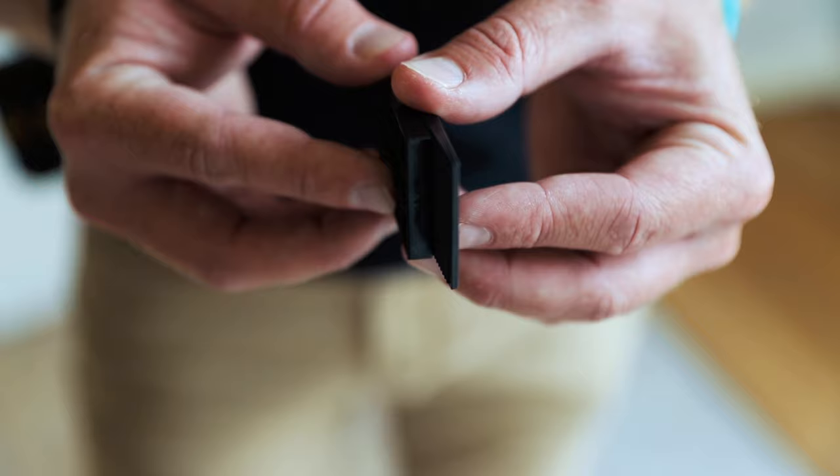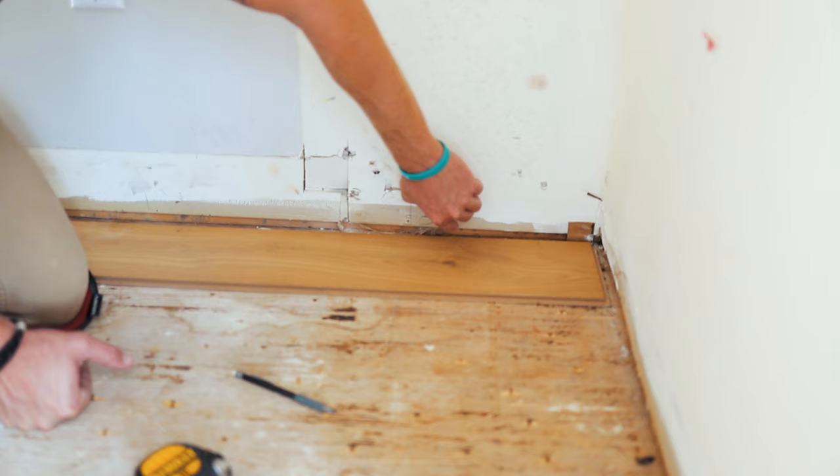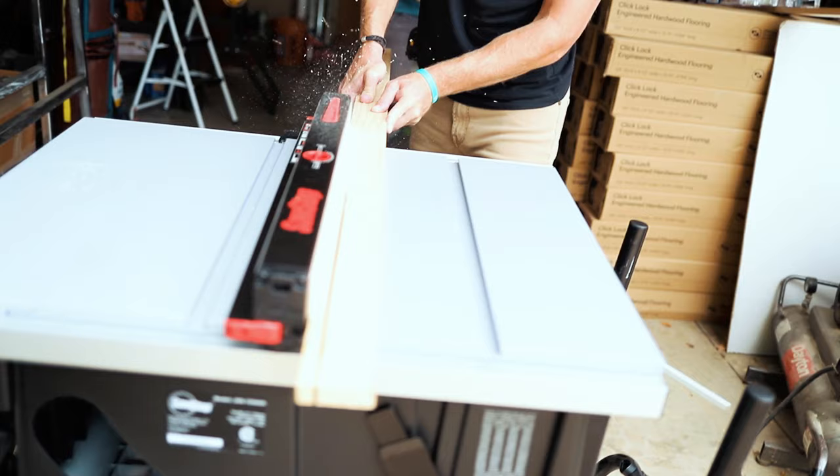It's really important that you get that first run shimmed and braced to the wall. Because this is a floating floor project we're not using nails or fasteners, so it's really important that it be shimmed and braced to the exterior wall so that as you're moving across the floor it stays solid and right where you want it to be. We had these handy adjustable shims, but unfortunately we weren't able to use them because the drywall stops a little bit short of the ground, which made the shims want to buckle into that gap. So it was wiser for us to cut our own custom shims — not a big deal. Once we had our chalk line we just measured off of that to figure out what thickness of shims we needed. It took us about an extra half hour, and then we were off to the races.